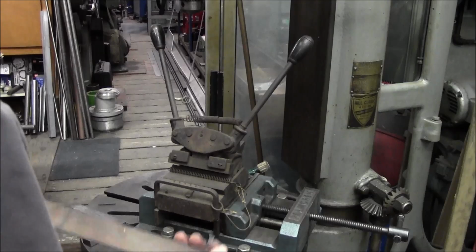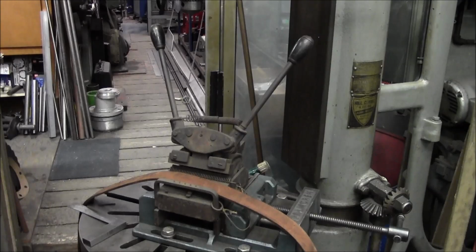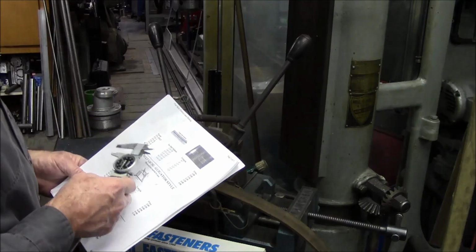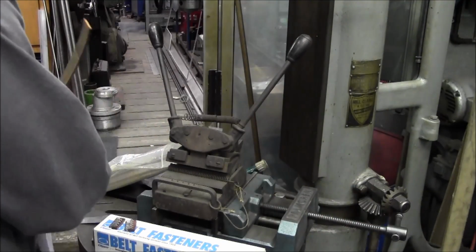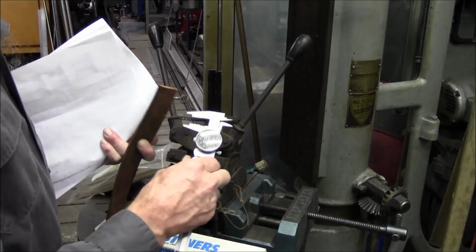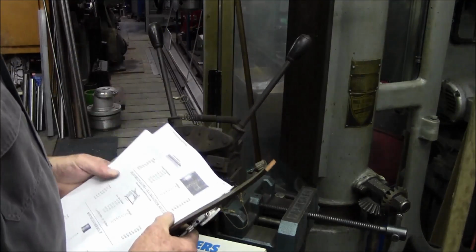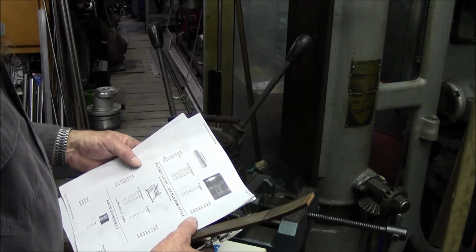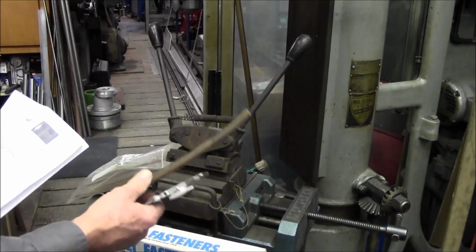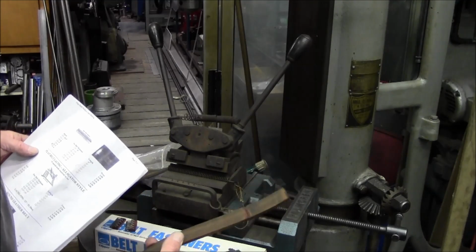All right, let's go ahead, and we're going to cut 2 sections of clipper lacing. All right, we got our regular printed out literature here, and we're in a toss-up here. Actually, we have 2 sizes of clipper lacing, and one is 3 and one is 4, and the numbers kind of correspond. Number 3 is 3/16 to 7/32, and number 4 is 7/32 to a quarter. And we're a little bit on the low side there, so we're going to run the 3. We're closer to being 3/16 of an inch than we are the quarter.